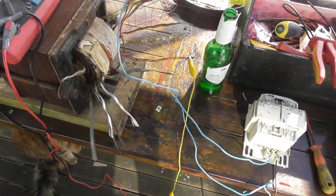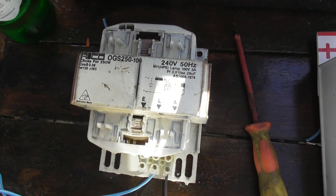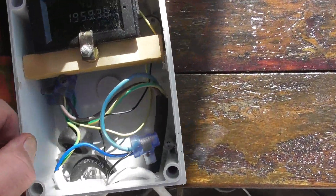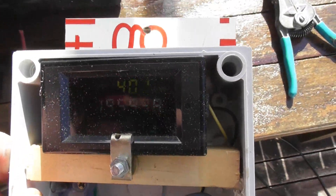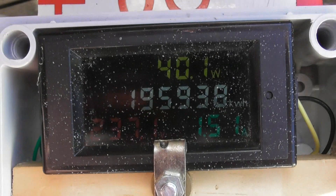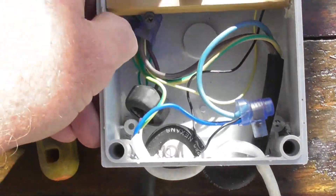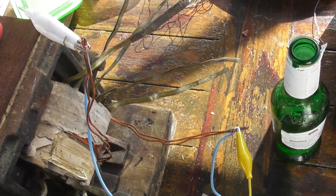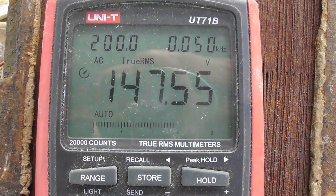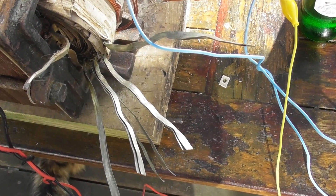Just approached this test a bit differently. What I've done - I put a 250 watt ballast, a streetlight ballast, in series. The middle load is 40 watts. And on this double winding, which is the primary, I've got 147 volts. I'm going to check all these tabs and see what readings I get out of them. We also know it's all good.